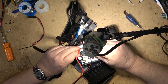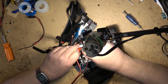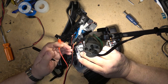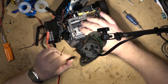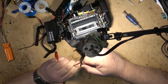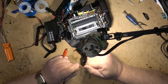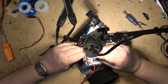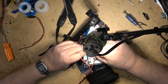I'll give the loading motor about three volts. I should be able to touch the terminals here — don't know which one's which. One will load it, one will unload it. My alligator clip just broke off the end of the cable here, so I'll have to reattach that. But if I can touch the wire in here to the terminal I should be able to get this thing to release the tape. Wrong way.